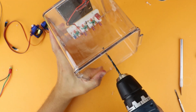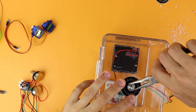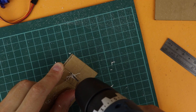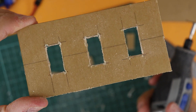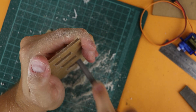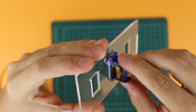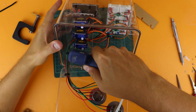These are the knobs I wanted to use — they look really nice. I ended up with a triangular arrangement which I quite like. Drilling acrylic is a bit of a pain, but if you take your time, use increasing drill bits, and some lubricant like WD-40, it works quite well — just don't push too hard. Then you can screw the potentiometer in place, connect the knobs, and it looks really sleek. Now it was time to put the servos in place. I cut out a bracket for them, made cutouts for the servos — that was a bit of a pain — but with a bunch of files and after a lot of dust, the servos finally fit in place. Using E6000 adhesive to fix the servos worked really well, and I used a friction fit with hot glue to wedge the bracket into place.